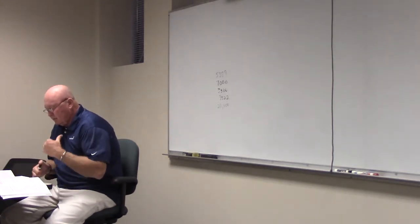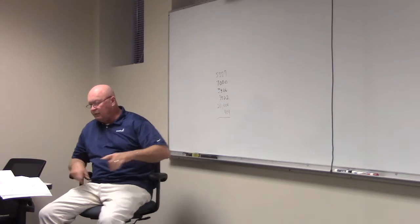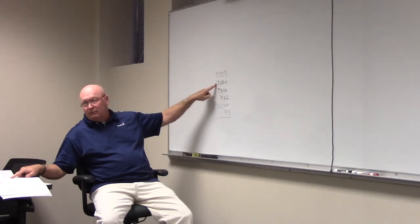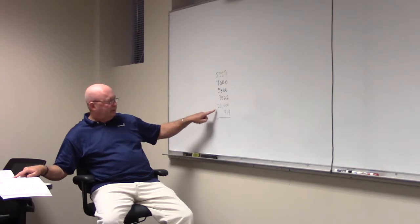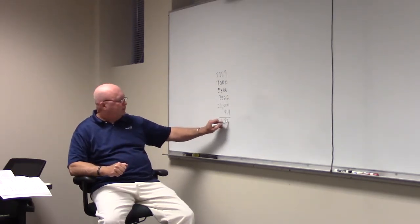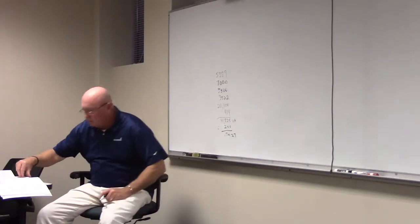We got to do the largest motor, and largest motor again is that 1656 one that we had. We're going to take 25% of that, which is 414, and we're going to add it to it. And let's add all that together. You don't have to do it because it did in your book. We got 5389, that's what we did, right? We got 7,000, which represents what? Range. What's 5,500? The dryer. What's 3,522? It's the fixed appliances. What's 20,000? Heating and air. And what's 414? Largest motor. 41,825 volt amps. How do we get to amps? We divide by what? 240. Comes up to 174.27. Let's see what they tell us to do on the next page.